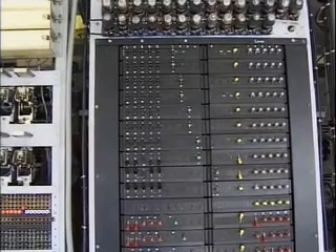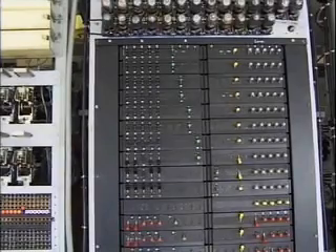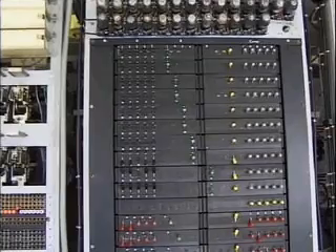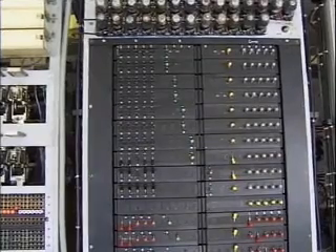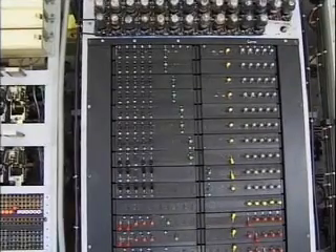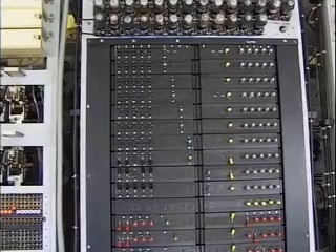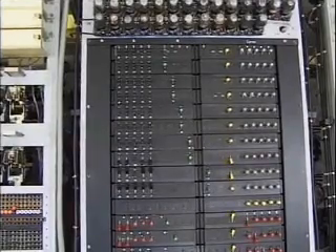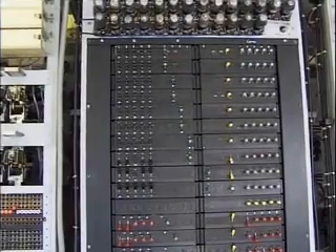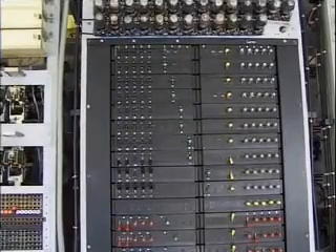Searching the whole of the possible combinations of wheel start positions was a very long process. The engineers, Tommy Flowers and Co. at Dollis Hill, added a very nice feature onto the Mark II, which involved remembering the previous four characters from the chi-stream and then doing multi-testing simultaneously on the Z-signals coming from the tape. This speeded up the whole operation by a factor of five, which was very impressive indeed.